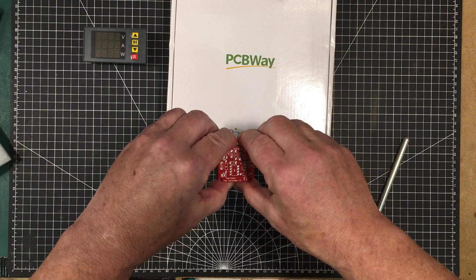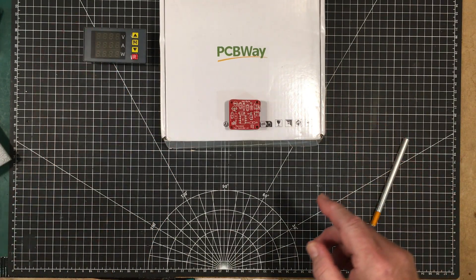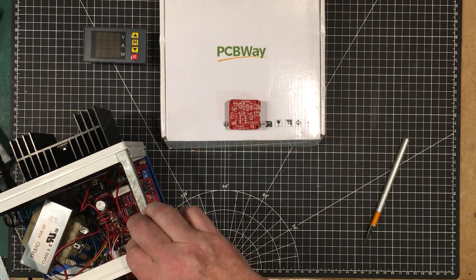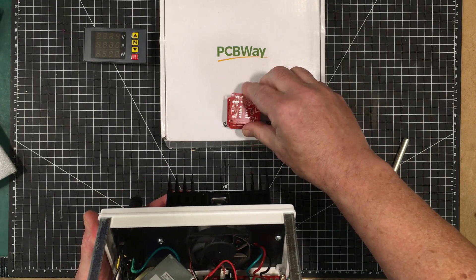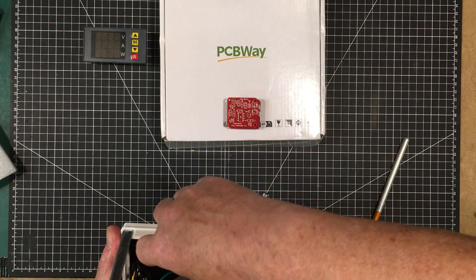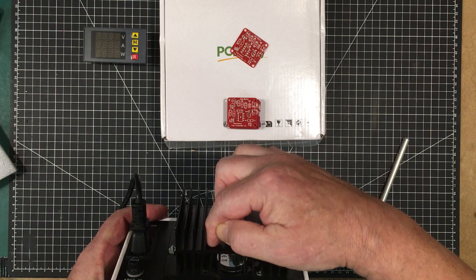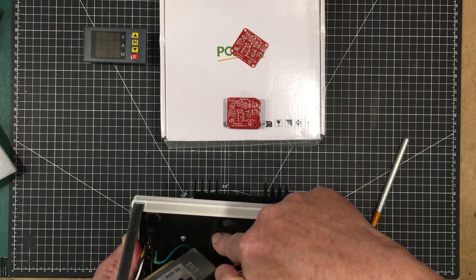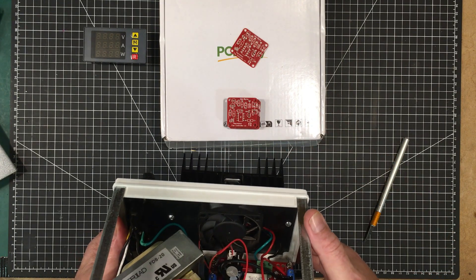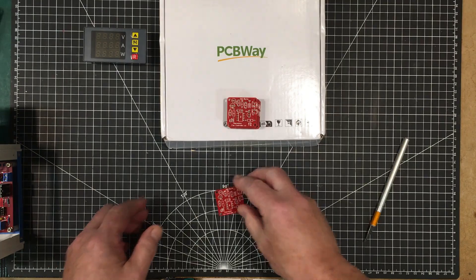What we're going to do is build one of these boards up. I'm going to simplify things somewhat — rather than completely dismantling the unit, I'll just stick the board on here with double-sided tape close to the fan. I'll mount the thermistor underneath one of the fan screws, drill a hole, and bring the cable down through an open screw hole to connect it to the controller. Let's get started — first thing is to assemble one of these boards.